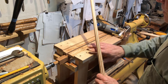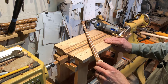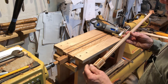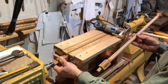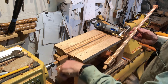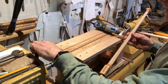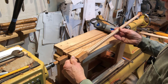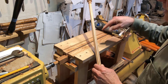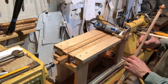Now I'm using this fixture here fastened to the lathe, and I've got one of the columns in the lathe fixed. I've got a position located here with a pin on the indexing system. There are eight flutes, and I'm using the Dremel tool to create these eight grooves with the indexing on the lathe.